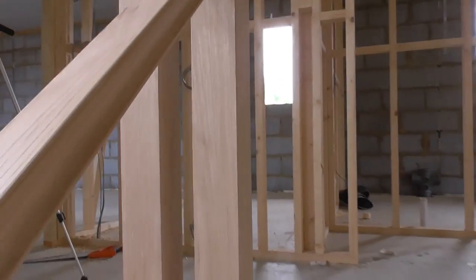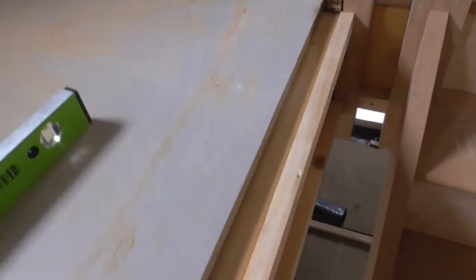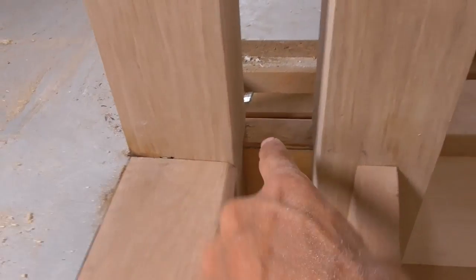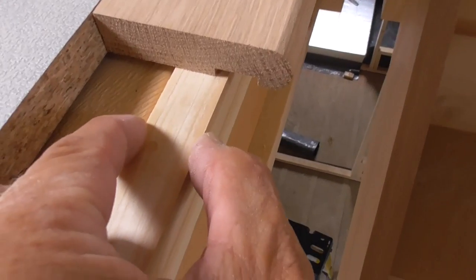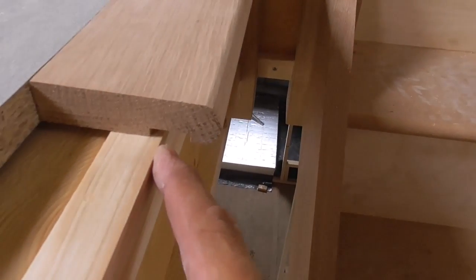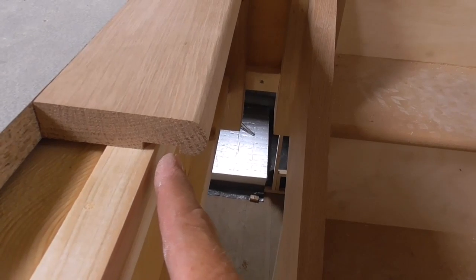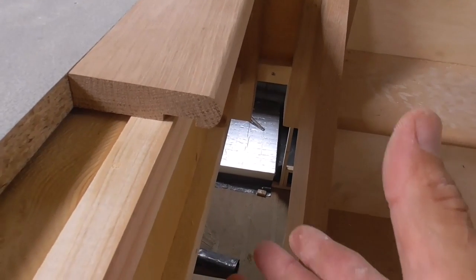I just want to show you the detail. Basically this is the floor capping bit that we put on. I've cut the flooring back and what that enables me to do — if you look here — is this floor capping is exactly the same width as the newel, and what I've then done is cut this. It managed to coincidentally be 25mm. So basically what that leaves — you can see this distance here between the face of this timber and the inside edge of this groove — that is exactly 15mm, which is half inch plasterboard plus some skim.